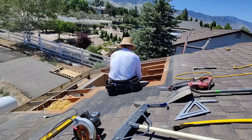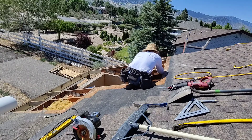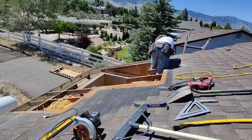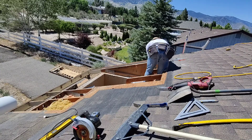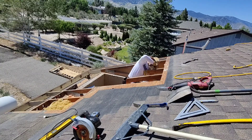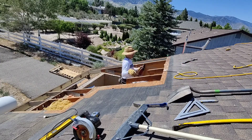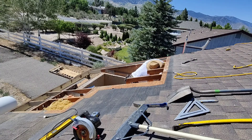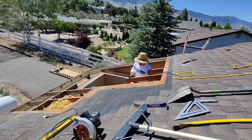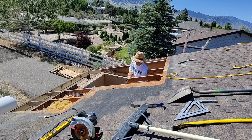Still cutting away a little bit more, a couple of bits and pieces. Now I'm marking the ends of those cut trusses to a 45-degree angle — there's a little bit more to be removed back there. I did the 45-degree so the new piece is lying on top of the old and gets supported that way. Fortunately, one of the three trusses was cut back so far that it's still under the roof decking, so I had to do that out of sight under there, but it turned out just as well.